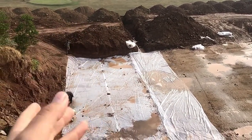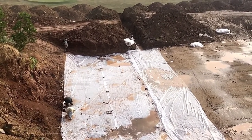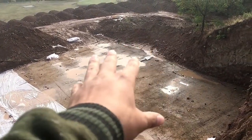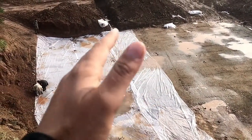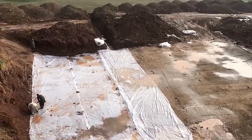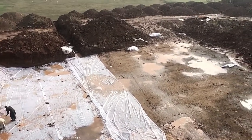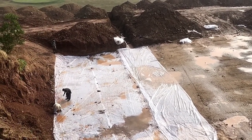So we did this process of covering this whole surface with plastic sheets. This is plastic sheet, and we know that rain is not going to cross this plastic sheet. We have covered this surface. You can see that the side which hasn't been covered is fully affected by rain, and this side that we covered with plastic sheet — where we are going to execute our foundation work — is saved from the rain. This is a field technique you can apply wherever you are working on a building site or wherever you need to do foundation works.